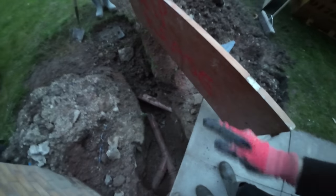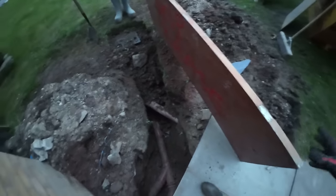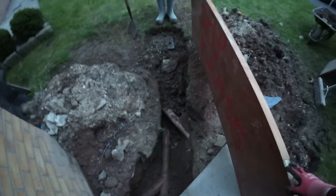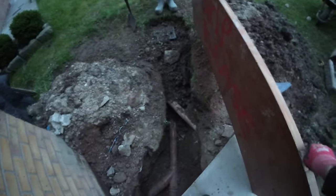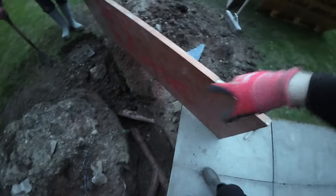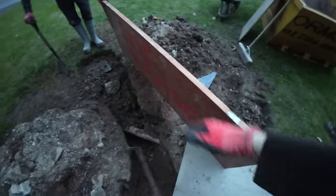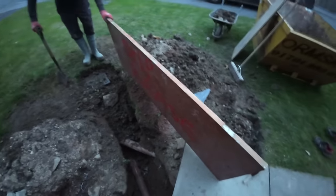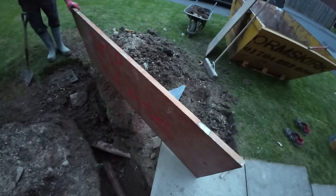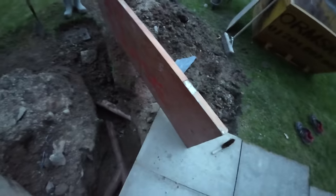And the plan forward now is obviously that pipe needs moving, and the best way to move that would be to dig the foundation. So each available day we get, we're gonna try and finish on time at work, give this half an hour each evening, and then any days we get free, we're just gonna tackle this. Because once that's dug, we can move that, and once that's moved, we can concrete it. I'll also have to put some chamfer boards down there, because it's gonna be a wider foot in there. What are chamfer boards for? Something on an angle. Every day's a school day.